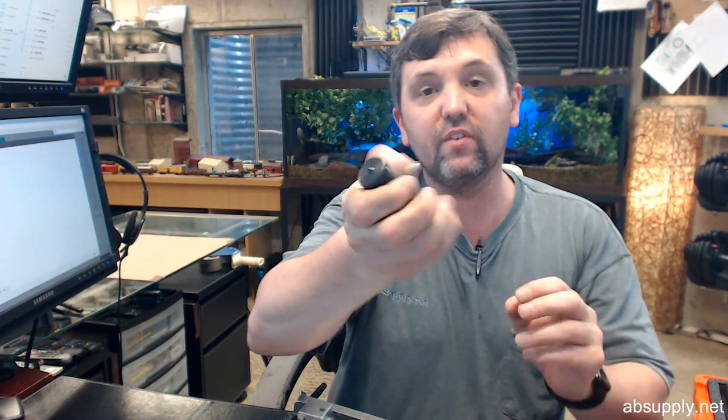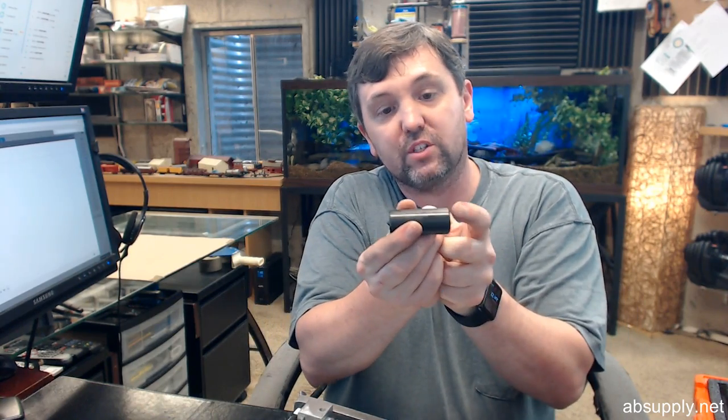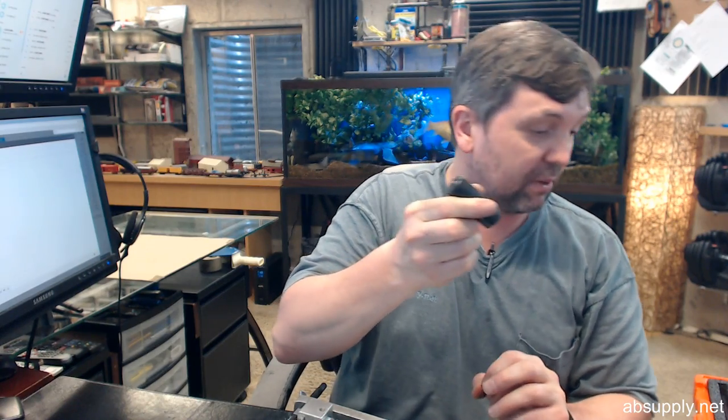Now the next tool, which is worth its weight in gold, is the marking tool. Now you've got a 2 1/8 hole or a 1.5" hole through the door. You've got your 1 inch in the edge. You're going to insert this marking tool down through that hole, push your finger in the 2 1/8, and mark the frame. Now you know the center line of where the strike has to be for the frame.